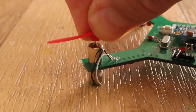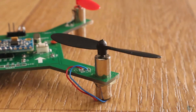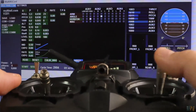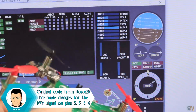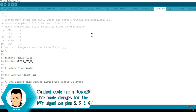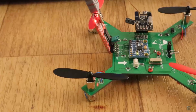I put the propellers and the drone is ready. Now it's time for the code. I've used the MultiWii version that is adapted to receive signals using the NRF24 radio module. It will create a PID algorithm and control the motors, and I was hoping that it will fly straight. Download this code from a link below, connect the FTDI module, open the code in the Arduino IDE and upload it to the flight controller board.